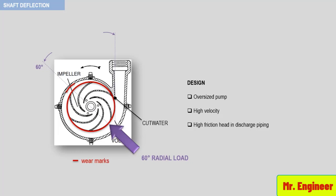And finally, this could also be induced or caused by maintenance. In cases, for example, where the mechanic installs a check valve in reverse, or uses inadequate practices when rebuilding valves, cutting and placing flange ring gaskets at pipe joints, or exchanging and replacing incorrect valves. Our recommendation in this case is to always use good maintenance practices.